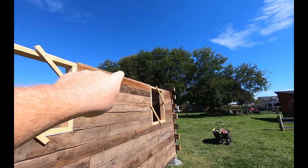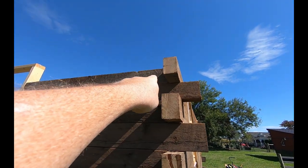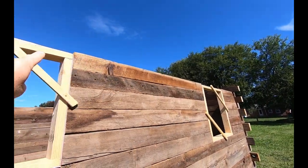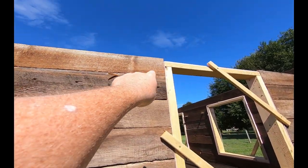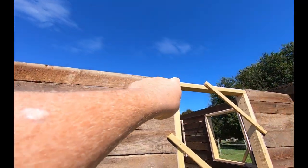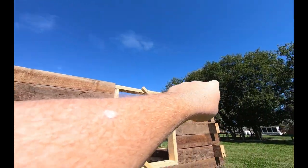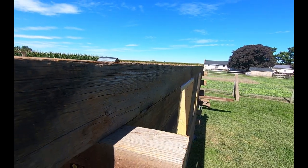We're almost ready to put this one on here. I've got to overlap the edge — I'll just leave it loose here on this end. Then I can get a measurement for this one, put that one on, and then we're going to have to straighten this wall out. I'll get up on a ladder in a second and show you that. We also left off the other day when I was putting this little sliver in — that raised this piece of the course up above the window frame, just about the same as this one over here. Here's the one I put on off-video on the back wall; it's really straightened that out well.